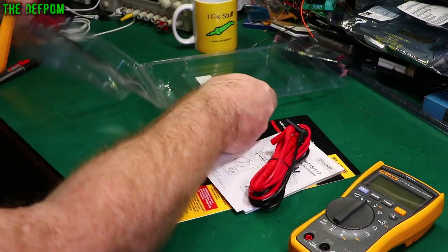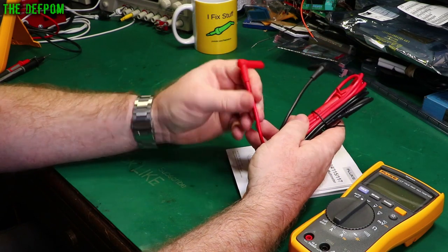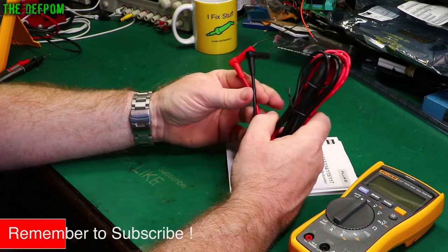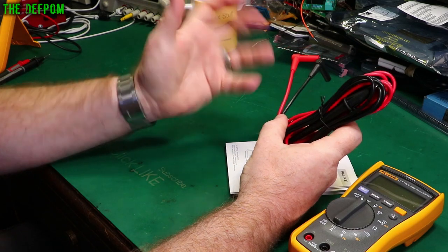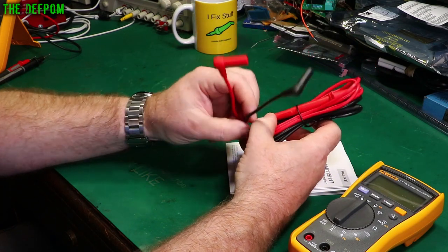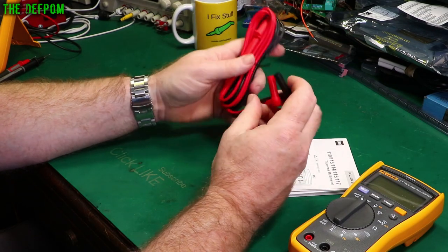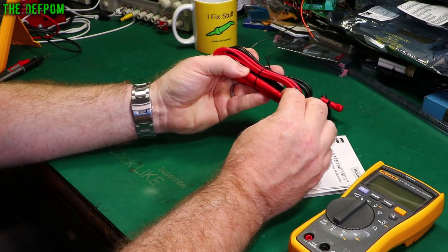Let's get rid of the packaging. We've got some leads, probably 1.3 meters long. These are PVC leads and they're actually a bit stiff. PVC is made flexible by adding a plasticizer — depending on how much is added, it changes the flexibility. Natural PVC is quite rigid, and this one has a slightly lower dose of plasticizer than the previous set I got. PVC leads are okay, but if you want better quality, Pomona and Fluke also sell silicone leads. These are rated Cat 3, 1000 volts; Cat 4, 600 volts; 10 amps. They've got the little clips on the end with only the very tip exposed.